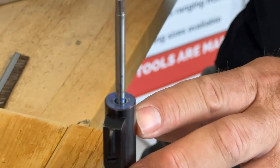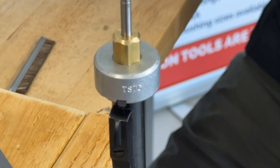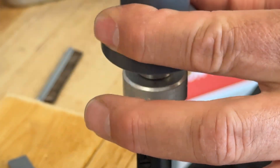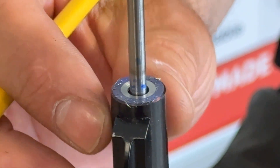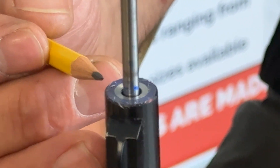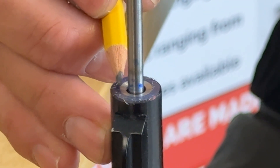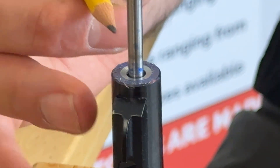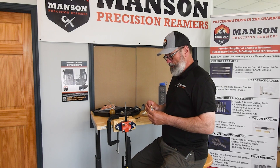I've used my magic marker to color in my muzzle face. For this quick cut I'm not going to use any cutting oil — you're not going to hurt anything doing that, but you don't want to do that for extended periods of time. I'm just going to do a couple of rotations so you can see our progress. That blue remaining face is what we originally cut with the zero degree cutter; the cleaned-away face is what we're working on now with the 11 degree cutter. I'm not quite halfway to the outer edge — I'll probably bring it out maybe a little bit more than halfway, but I want to leave a fair section of that zero degree face on there.